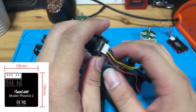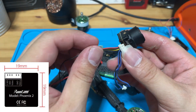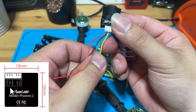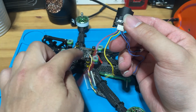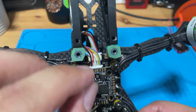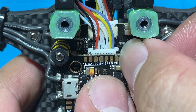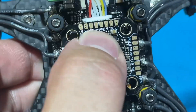Let's pull out the wiring diagram for the Runcam Phoenix. In general, you will need to solder at least 3 wires to the flight controller: the first is 5V, the second is ground, and the third is the data cable which transfers camera footage into the flight controller. For this particular flight controller, you can see there is one location with a ground, a 5V, and a VDO IN pad. Let's solder this up.